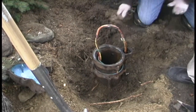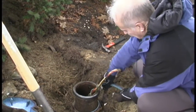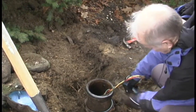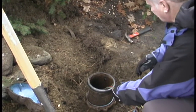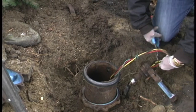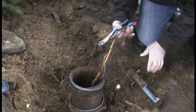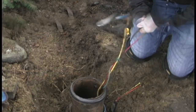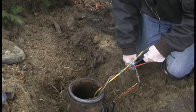Using a chisel hammer — it's the only way we can get it off. Now we're going to pull that nipple out of the electrical conduit tube. We still have the wires going around, so what we have to do is cut them so we can remove the old cap base. That should free them, no problem at all. Now we'll remove the gasket and the remaining cap base, but first we're going to trim these wires off a little bit.